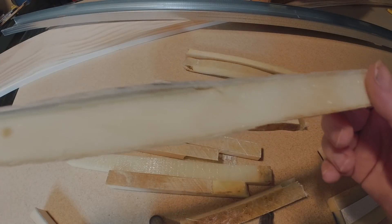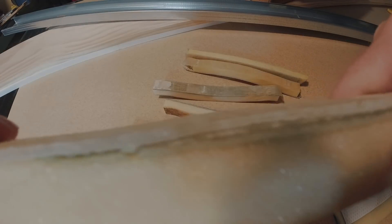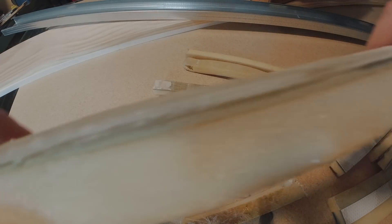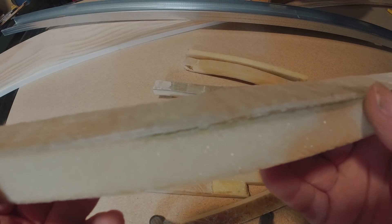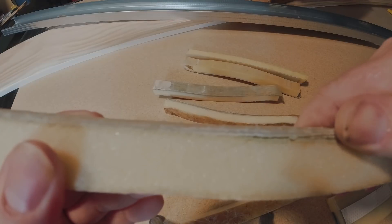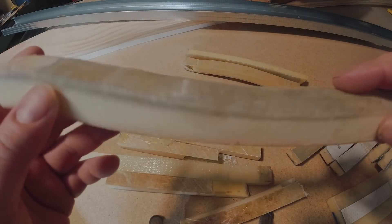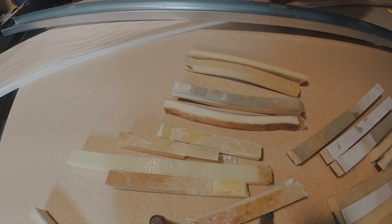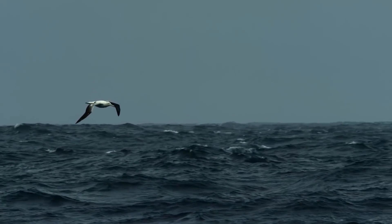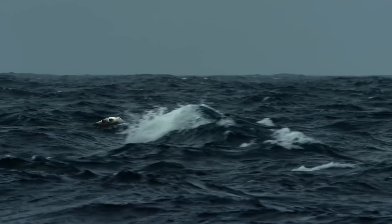Polyester — you might think this one is hardly damaged so it's probably good, but what happened is it starts to delaminate, and you can tell all the way through it's not even sticking. This is the only repair I would say actually failed. I would never consider using polyester for secondary bonding because it's going to break — not a failure of the laminate, but a failure of the bond. With any of the others — vinylester, no problem; epoxy, either epoxy, no problem in the bond. For all my stuff, I want to feel safe when I'm out there, so I've tested everything, torn it apart, done peel tests, making sure everything is solid and works.